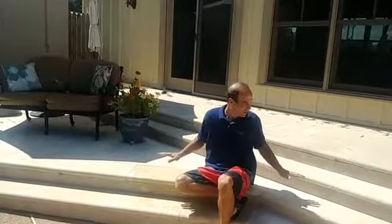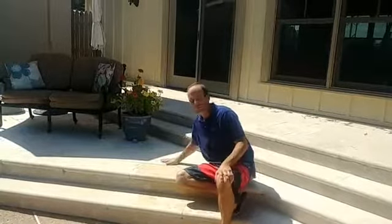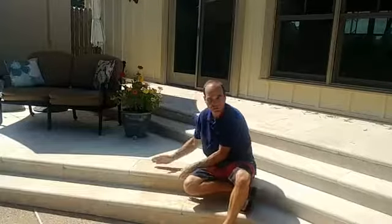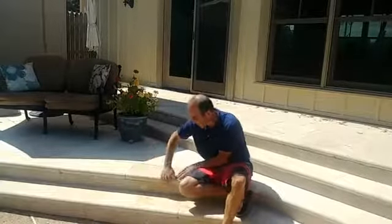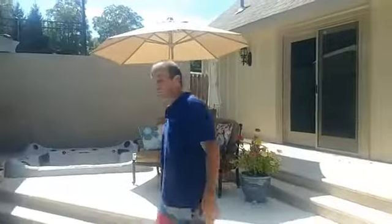Another thing about travertine is it doesn't get extremely hot, so you can actually walk on this on hot days, so it's a good product. Now this is tile here over concrete, worked really well. These are what you call stair coping, or pool coping, I'm sorry, which are made to go around the pool. C-O-P-I-N-G, coping is what I'm saying there. Or you can use these for stair treads like we've done. They're about 12 inches wide, 24 inches long, and they've got this nice bullnose on them. So this actually worked really well. So that's a little tip I'll share with you too.